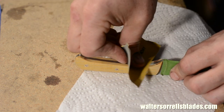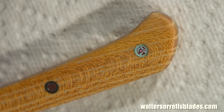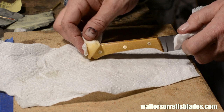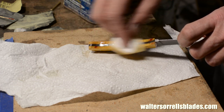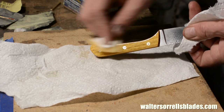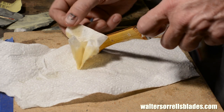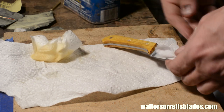Finally, I'll pretty everything up with a final hand polish using thousand grit sandpaper. I don't know much about this wood, so I experiment on some scraps to find an appropriate finish. I always recommend trying different wood finishes and just seeing how they work out. As a general rule, I don't like giving working knives a hard finish — by which I mean polyurethane, lacquer, things of that nature — they tend to get scratched up and flake off over time. So oil finishes that just soak into the wood are my favorite. They don't bring out quite as much detail on the grain of the wood, but they're more durable and forgiving. So I'll give it a couple coats of tung oil and let it dry, then I'll polish it up.